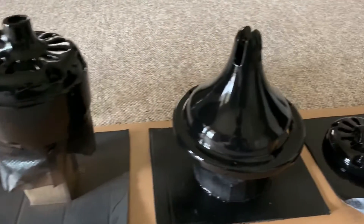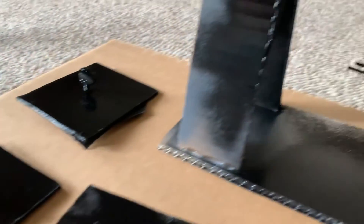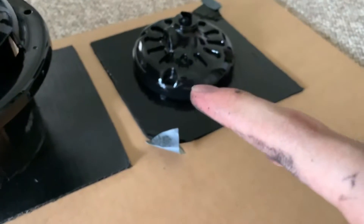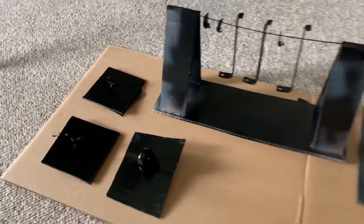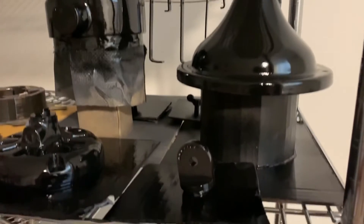Here are the parts I've painted today. I still have the cage and some other small parts to paint but that'll be done another day. These came out really, really nicely — the gloss on it is beautiful, especially on the motor housing. There's the base and the rear motor housing. My hand is so shaky from holding that trigger on the spray can for hours. They are now in the workshop still curing — I'm going to let them sit for about two weeks to let the paint harden, and they should be ready for reassembly.